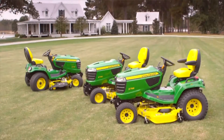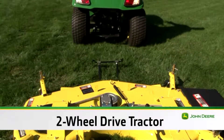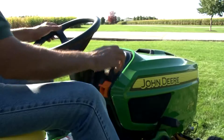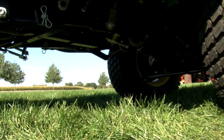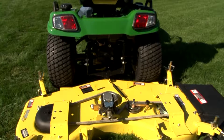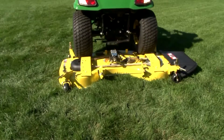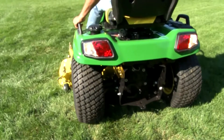The next few steps are different depending on whether you have a two-wheel drive or four-wheel drive tractor. For a two-wheel drive tractor, position it in front of the mower deck with the rear wheels toward the mower. Pull back on the tractor's top hydraulic lever to raise the mower lift arms to the highest position to make sure the mower lift arms and the auto-connect carriage do not interfere with backing over the mower. Line up the rear tires with the horizontal plates on the front of the mower; they should be centered between the mower wheel posts. Increase engine speed and back the tractor over the middle of the deck ramps, continuing until the rear tires are on the other side of the mower.